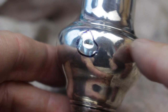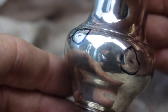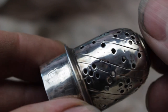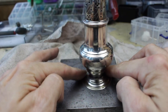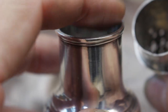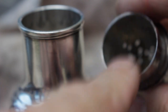It's fairly good condition overall but you can see there's a very nasty dent there and that's a big thing to take care of. If I rotate it round you can see there's a couple of little dents here. Going round I can see some tiny little dents and scratches, some superficial marks. There's quite a bit of tarnish on it — nothing major but all little things that need addressing. If I put it on a metal block, I can see a couple of little gaps around the bottom and I might just tap that down to make sure it's flat and stands straight. The lower part is perfectly round but the top part is slightly off round so I might just make that completely round.